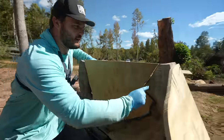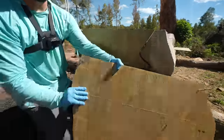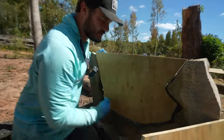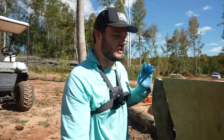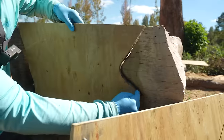The plan for the front and the back. We took sheets of plywood earlier today and we marked the exterior to give us the exterior piece of our transom. Then we marked the interior. So we're gonna have two separate sheets of plywood, gonna give us a little bit of firmness. We just went in with a Sawzall and cut these funky shapes out. If you can tell, we have a little bit of a gap all the way around.